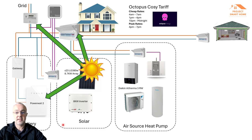I've got the Eddy as well. If I have additional solar that's not being used in the house and not being used by the battery, then the Eddy will detect surplus energy going back onto the grid and start redirecting that energy into the immersion on the water tank — so it's doing a fantastic job heating the water up as well.